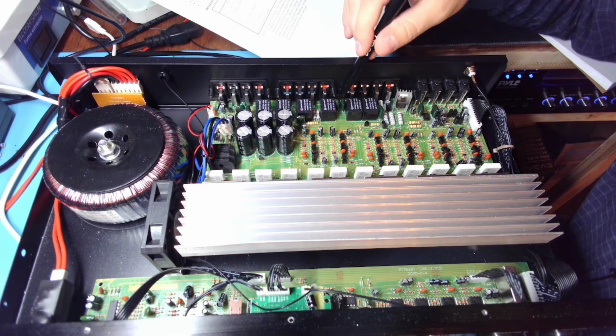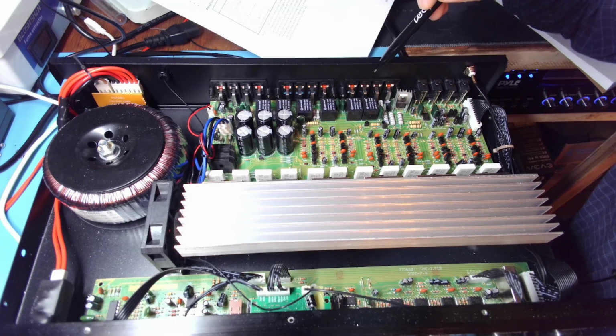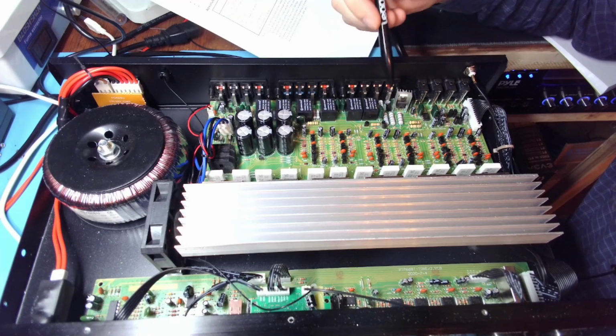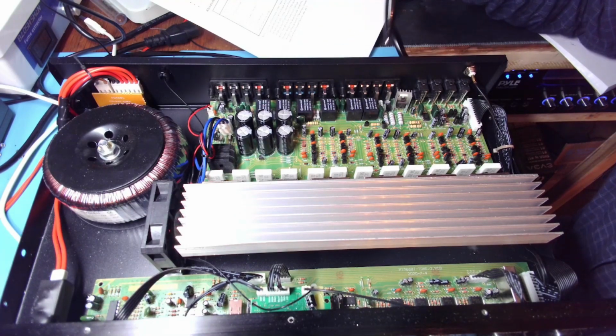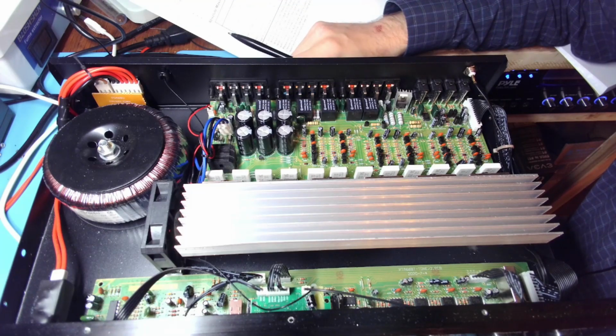So someone figured that, yeah, these are 12 volts, but let's supply them with 16.5. That should be fine, right? We saved money on a 7812 regulator, and now we have a device that can cause fires.